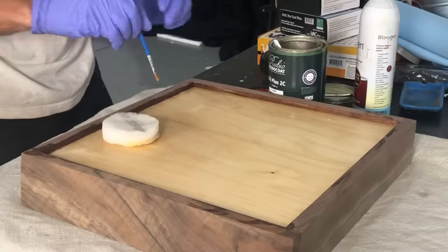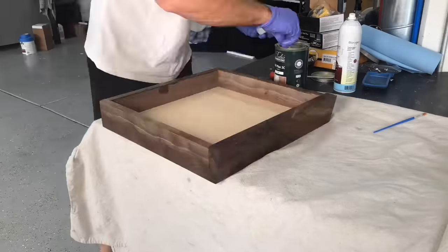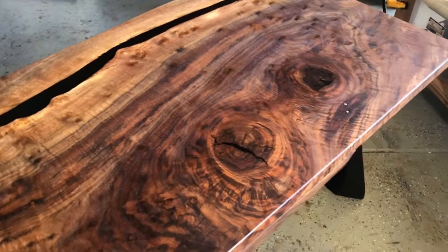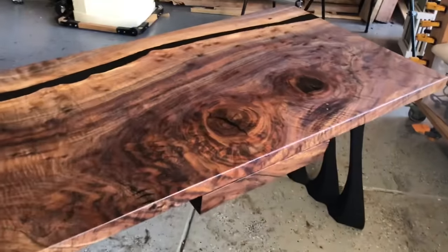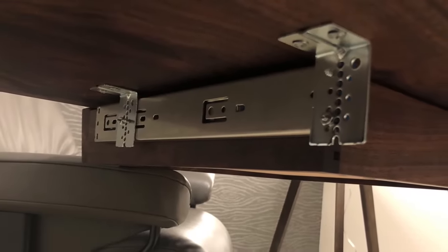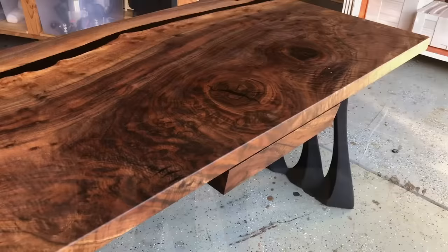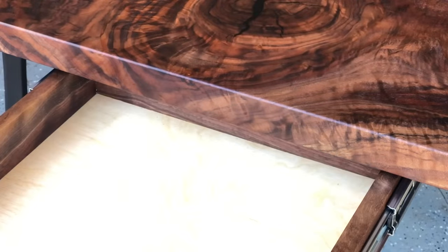What turned out to be trickier than I thought was attaching these drawer slides to the underside of this slab, because I originally wanted a really cool undermount hidden push-to-open soft-close drawer slide — and apparently that's not a thing in the drawer slide world, because most of the time they go in cabinets and are undermount to something solid underneath, not hung down from a slab. So I had to pirate some brackets off of one drawer slide and attach them to another slide that was actually a soft close. In the end I didn't love that you can see the drawer slides from the side — it doesn't look great — and they are a little bit hard to open because of the soft close, but the action is really smooth and it works great. I was just hoping for something better in terms of the hidden aspect and maybe a push-to-open.